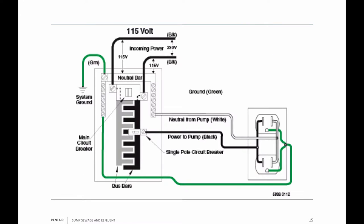Now let's look at electrical. Incoming into your house are two 115-volt systems — put a voltmeter between those two wires and you read 230 volts. Those wires connect to bus bars: one positive, one negative. A 115-volt cable has three wires inside: a white neutral wire, a black hot wire, and a ground wire — usually a solid copper wire, designated green on drawings. You pull back the cable insulation and connect the black wire to a single-pole single-throw breaker.